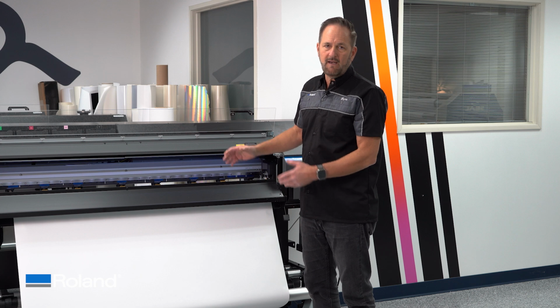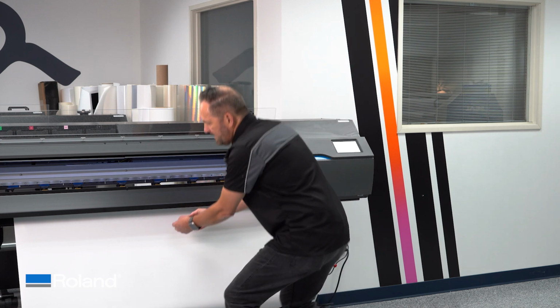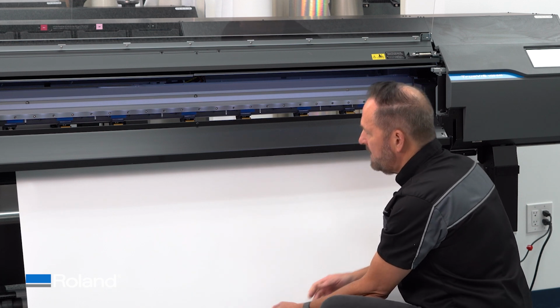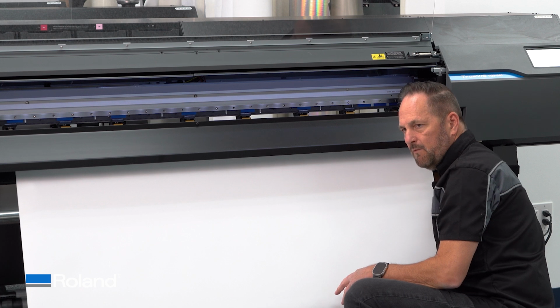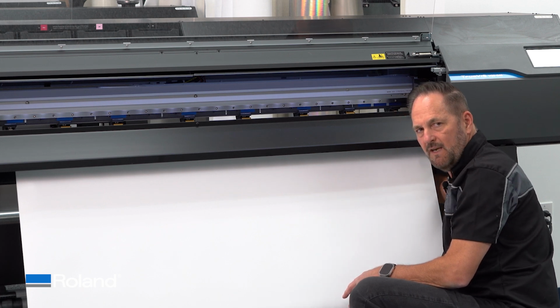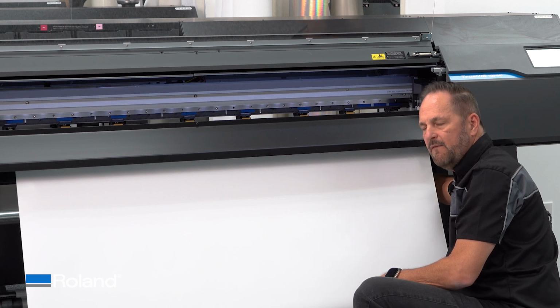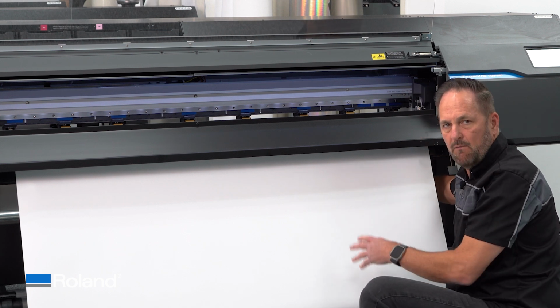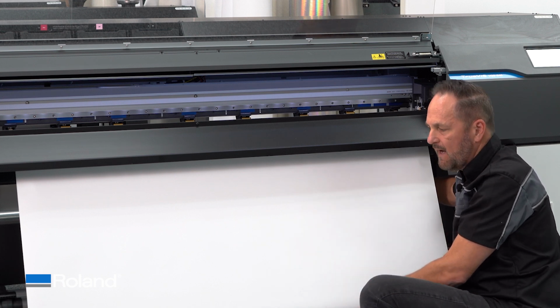And the best way to do that, again, is starting slow, go from the back to the front, take the tension, pull down the center. Again, you can check your alignment from the front to the back. I sometimes will reach through the machine to the rear of the machine to the take-up flange, or the media feed flange, and actually manually rotate that front and back. So we basically start making sure the track is correct.